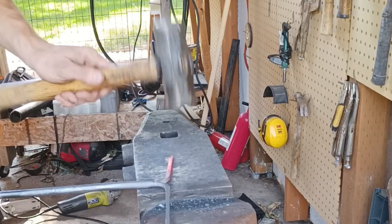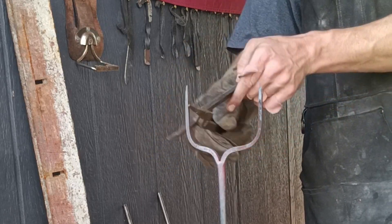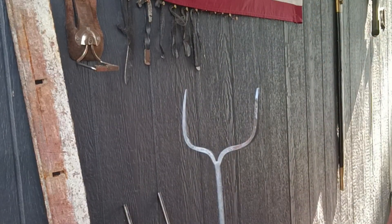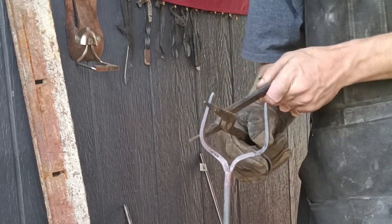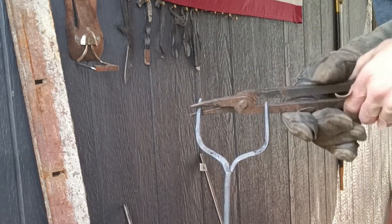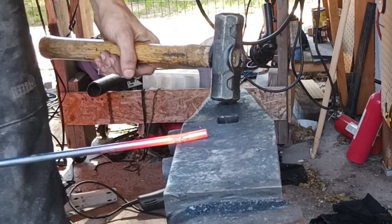With this last one done we can run over to the vise with a pair of scroll tongs and bend these up and turn the points up as well so that way we have our nice little forks going on. It's hard to see on camera because of how much of an overcast day it was, but you do want to make sure that your metal is pretty hot when you're working these things since they are so thin — you don't want to create a bunch of small micro fractures or accidentally shear your metal.